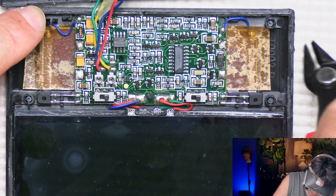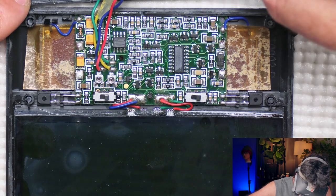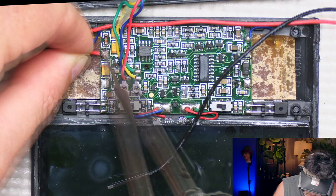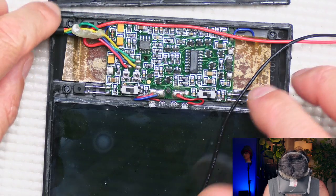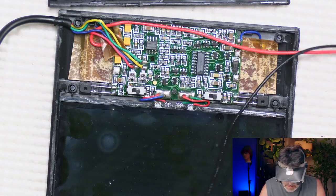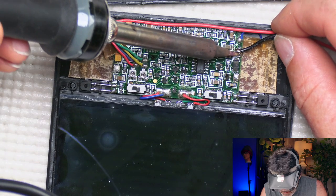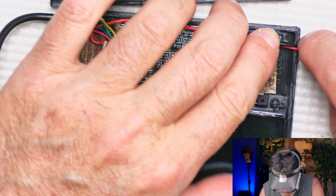What I would do is carve out a little spot on this side for the wire to pass through — kind of like they did over here — just big enough for the wire to pass through. I'll put a link below to the battery holder I'm using. We'll solder our positive wire on, then put our wire back in place. On the negative wire, it's too long now, so we'll make it shorter, strip it back, and tin it with a little bit of solder. And that's basically it — run the wires over to the little notch right there.